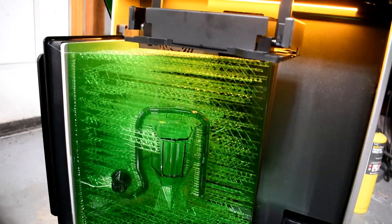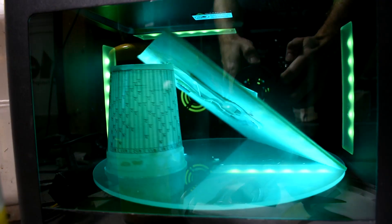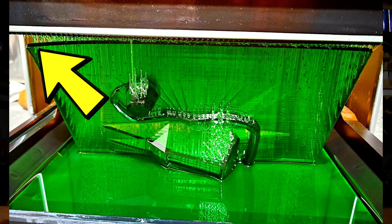Admittedly, it's much too large for this project, so I had to print the matchplate out on a GK3 Ultra — the really huge one. I love these huge printers. Please, somebody make one that's a meter. Two meters. If I can print an entire kitchen table on it, that's almost big enough. Anyways, I ran into some issues with the printing. You can see it pulled free of the build plate — I didn't anchor it quite hard enough on the bottom. Other than that everything looks okay, and it warped slightly, but this is where the flasks clamp on so it's not going to be an issue.